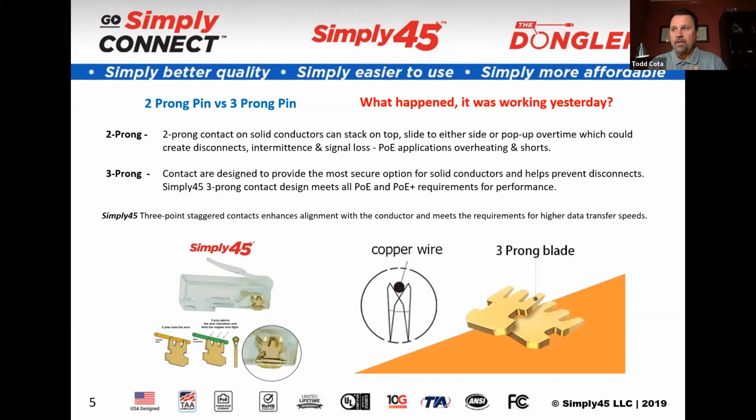So you test it out on the job site, it's working today, but any type of cable moves behind the scenes, or the contact could just pop off. That's where it was working yesterday, it's not working today. That scenario is bad because it typically requires a truck rollback to go back and fix it. But when it comes into power applications, it also creates heat, it creates shorts, it creates stuff that could be detrimental to the actual overall install.